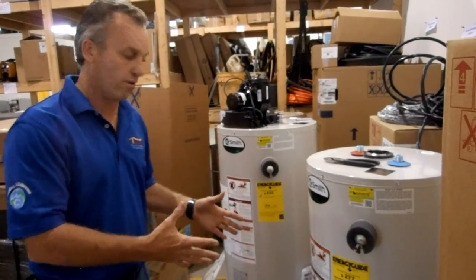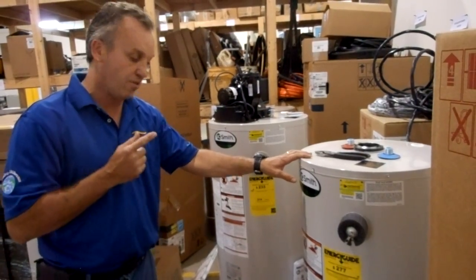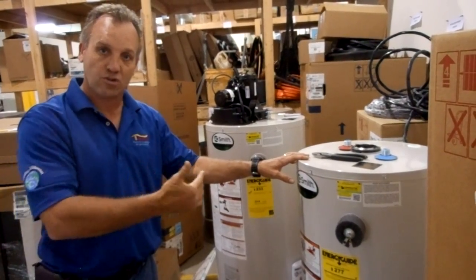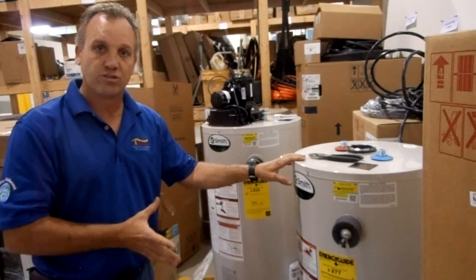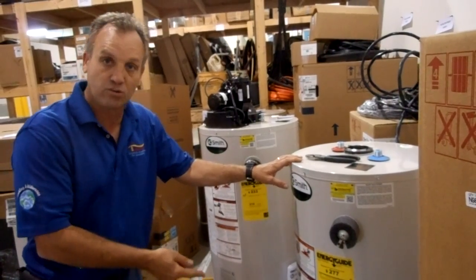On the atmospheric water heater, which we have here, it does not have a vapor sensor. It has a thermal sensor. There's a sealed chamber with a thermal sensor, so if the flame backs up where it doesn't vent, it will shut itself off. It is just a switch — dry contacts. It opens the circuit and shuts the gas valve off. They are resettable.